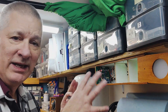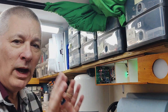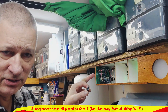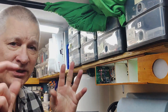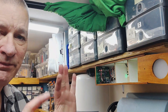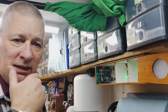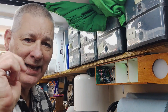At that point I was ready to rip everything out, put it back the way it was, and use that manual plug-in timer — which is a solution at the end of the day. But I thought: one more attempt. The ESP32 is already running three tasks, one for each NeoPixel circle, each corresponding to one of the three storage bins out back. So I thought: I'll put the code that reads the time from the DS3231 into another separate task — possibly even running on core zero.